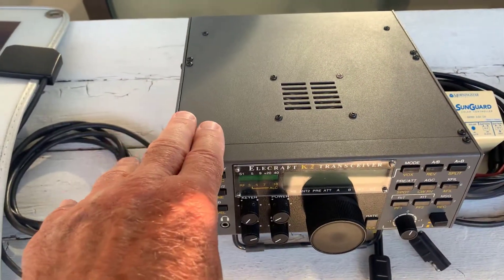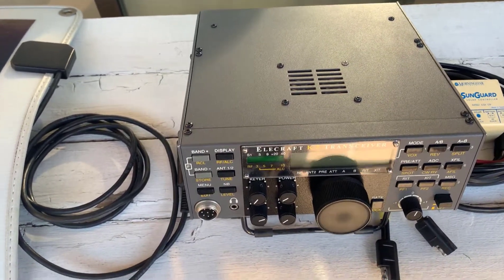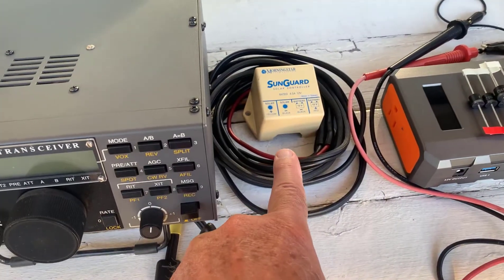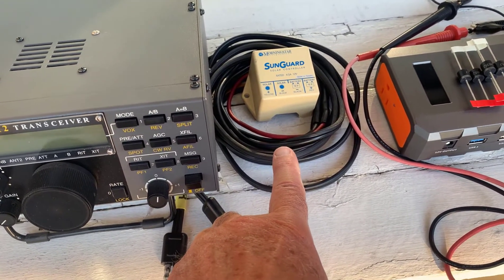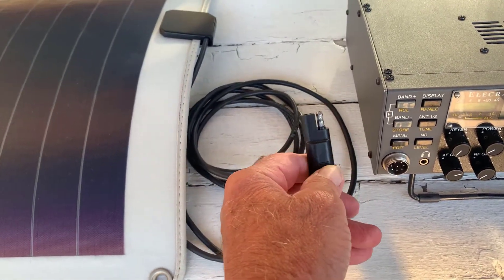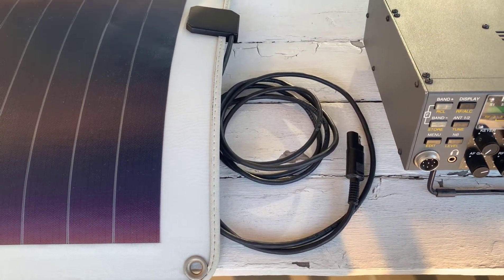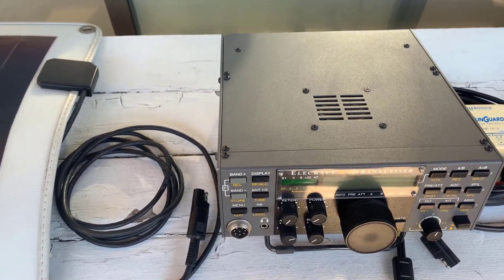Unfortunately, or fortunately for the radio, the radio has a steering diode, so you can't put a charging voltage in at the wrong polarity, which is smart because being human, we always make mistakes. Unfortunately, this thing is designed to charge a 12 volt battery directly. So if you've got a steering diode on there, it blocks the reverse current measurement, so it won't work. So what I did is I put — this is the output of the solar regulator — a heavy duty automotive connector. I put on a National Semi LM78 series regulator on there, and that worked very well to charge the 12 volt gel cell.